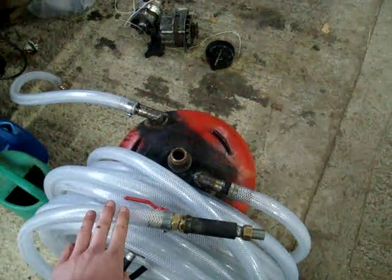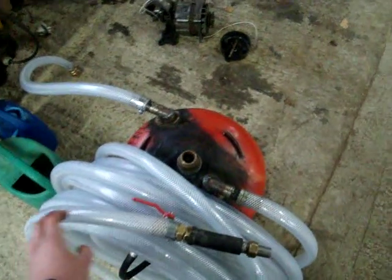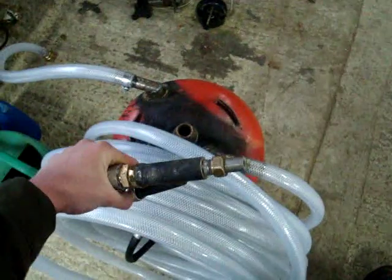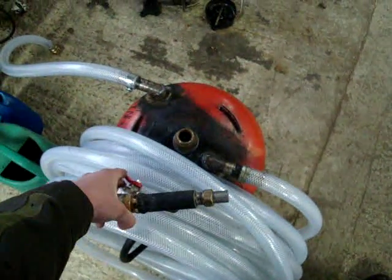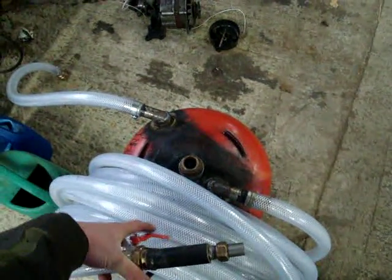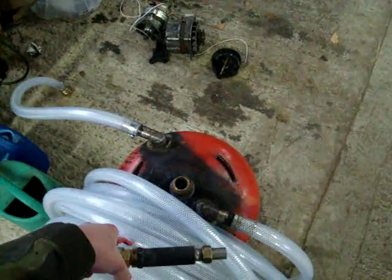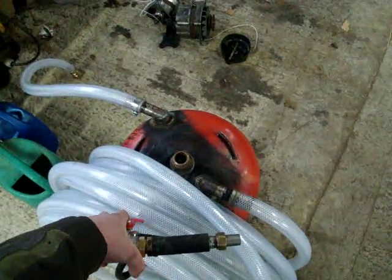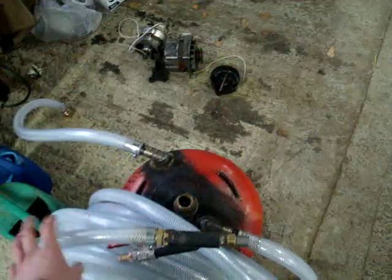The way I work mine is I've got the air coming from my big homemade compressor going directly through the air hose. But the sand is pressurized by my workshop air compressor, just a standard air compressor. I charged it up to about 60 PSI, so it's under a bit more pressure just to help it inject into the airstream.